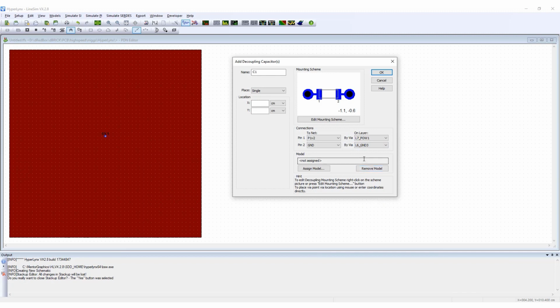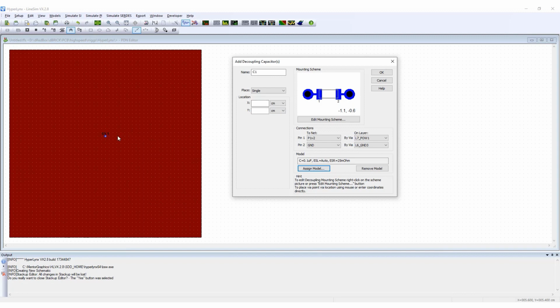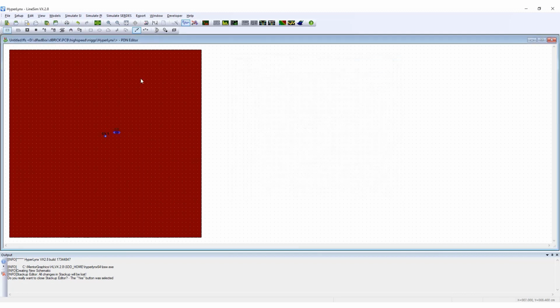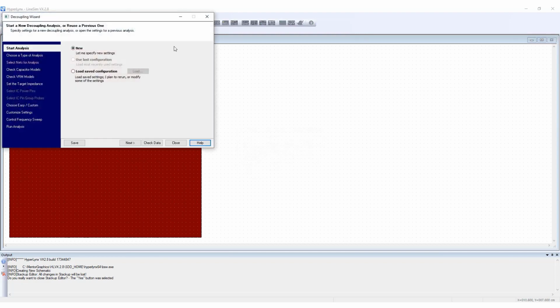Right now, we're going to validate our proof of concepts to guide decoupling capacitor locations and values for pre-layout and determine a target impedance. And then later on, I will revisit this strategy once the board is more populated and do an advanced decoupling analysis to see if what I've recommended indeed passes all the checks for board sign-off and was the optimal strategy for our target impedance.